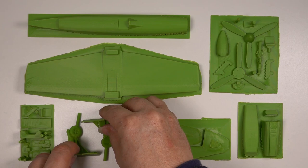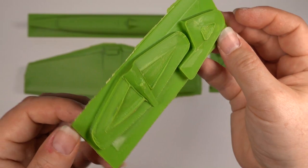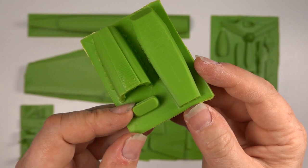The tails were the first part I'd printed in well over a year and were massively over extruded. Fortunately, the excess ABS is easy to remove and I just need these to be blanks so that I can file them down to the correct profile. The radiator and chin came out the best. Overall, I think I'll call that a success. 7 out of 10.